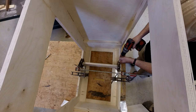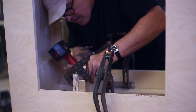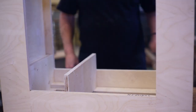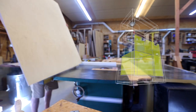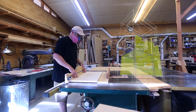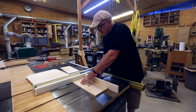To figure out the widths of the drawers I sort of reverse-engineered them to figure out how to do the parts in the cabinet, and now that I have the parts in the cabinet I have the dimensions to make the drawers from. It's sort of a reverse engineer and then a forward engineer to get to these dimensions, because in the end I need the shredder to fit into the smaller drawer. The drawers will be made out of half-inch birch plywood.